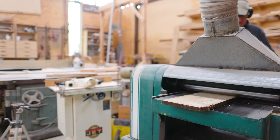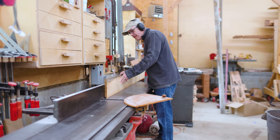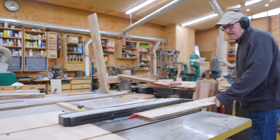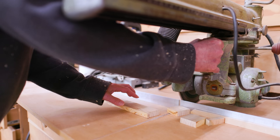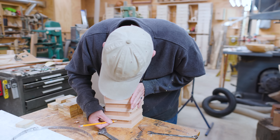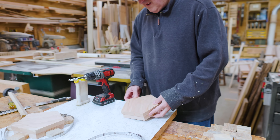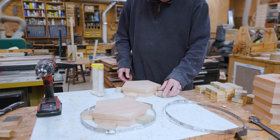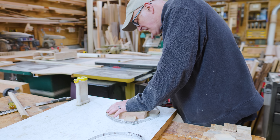The next thing to make were some tabs to glue to the outside of the pentagons. The depth of the cut only needs to be as deep as the thickness of these tabs, and really they're just squares of pine. I cut the pine into strips, then into squares, and I marked where the tabs would be glued on. The way I clamped these was to have five tabs around the pentagon — one on each side — but only three of them would have glue. I only did three because that's all I really needed to hold these in place on the CNC, and it would also give my pentagon with the tabs a direction.